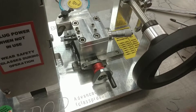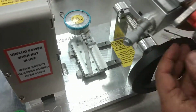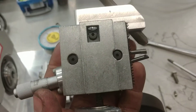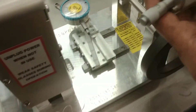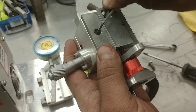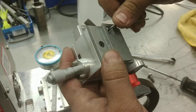Once you have that, the whole cutter assembly will slide out. Now you can see there are three black allen screws — those are the same size allen wrench as the gib set screws, which is 5/64 or two millimeter. Make sure you have it inserted all the way, nice and tight so you don't strip it, and then tighten those almost as tight as you can.